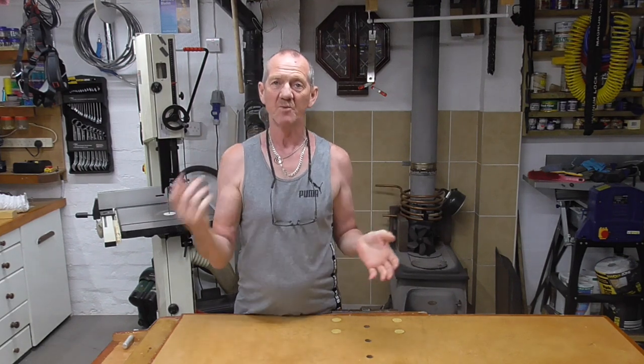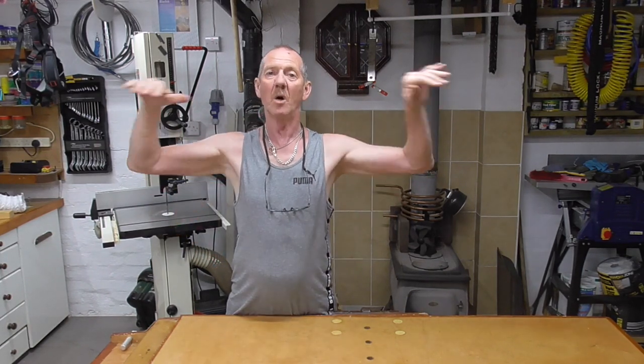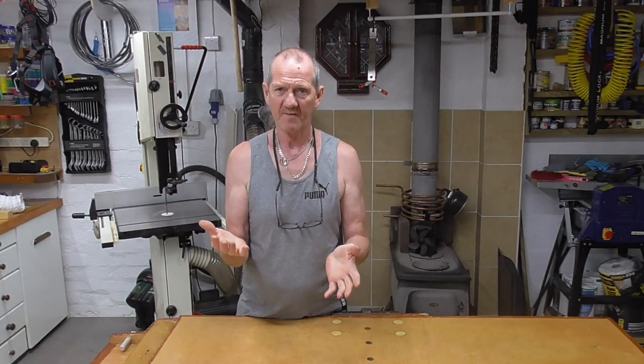Now, ordinarily, we use trims around the edge, a two-piece or even a single trim around the edge profile, which hides imperfections around the edging, also helps hold the edges up. In this instance, I don't want to, because it's going to make a funny appearance of the tops of the windows because it's so close. So what I'm going to do is cut them as a tight fit as I possibly can, leaving me just a fine silicone bead all the way around.